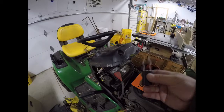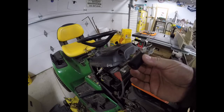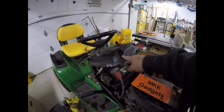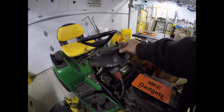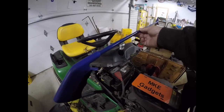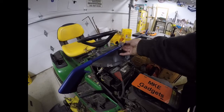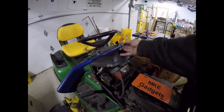So with the nylon piece I cut it off 1.5 inch long. It's 1 inch diameter. I drilled it 1/4. So these holes are made for a canopy, which I don't have. So I thought if I can use these holes with my clamp on, and then I can put my tool right in here. So as I'm driving, I can just take it off and pick up pieces of paper and litter and set it on the side, and I have the tool with me.